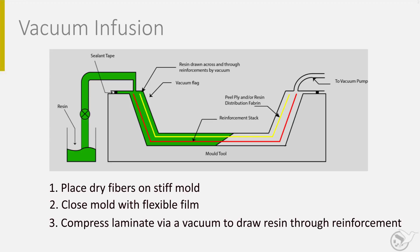Now, a vacuum pump extracts all the air in the vacuum bag, and the resin is infused into the fibrous materials. The resin flows driven by the pressure between the inlet and the outlets. Once the whole fiber package is impregnated, the process is stopped and allowed to cure. Parts are sometimes put in an oven to accelerate curing. The vacuum in the bag reduces entrapped air, like voids and porosity, and the pressure difference compacts the fibrous materials.